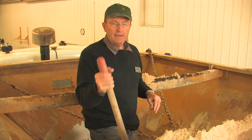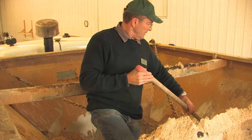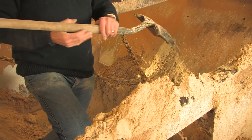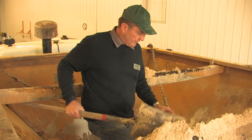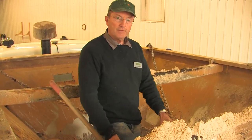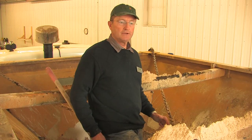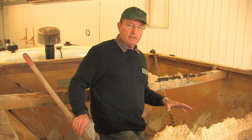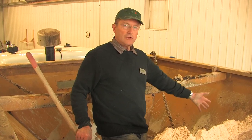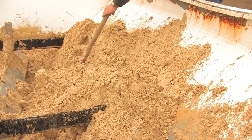Here we have another unit — it's stainless steel but it's painted, and unfortunately gypsum sticks to paint so it tends to hang up on the sides. In addition, there's a large shield over the belt that's close enough that gypsum will actually bridge. When we spread it in rain conditions it was more difficult to use, and the combination of painted sides and the shield creates an issue where we get a lot of bridging and don't get the flow we need down onto the belt.